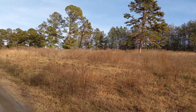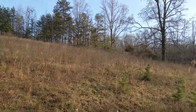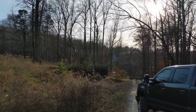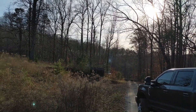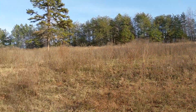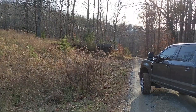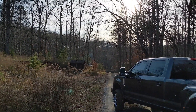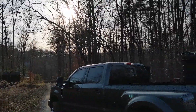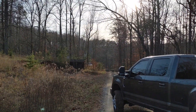That was a muddy day when we trenched. The tank up there services the house — it's the highest point we could reach on the property — and it's been absolutely fine. The house is down there, even the bathroom on the top floor, so you can take a decent shower. A lot of times you can overcome pressure with volume — P1V1 equals P2V2, hunters know that relationship. We ran inch-and-a-quarter pipe all the way down from that tank, so there's a tremendous amount of volume coming toward the house. It won't give you the pressure of a normal 40-60 pressure switch, but there's no bladder tank, no pressure switch, no controls at all — it's just the three panels keeping that tank full.